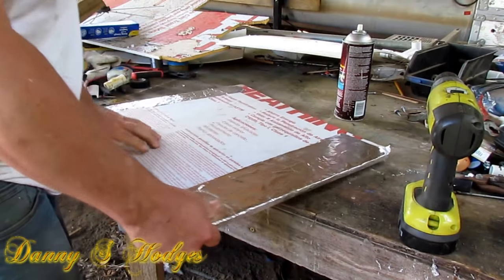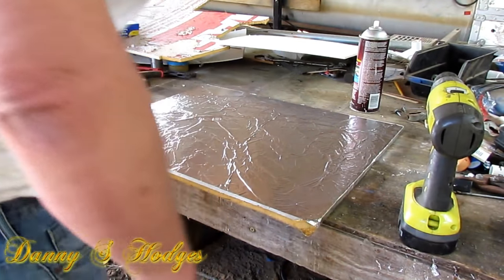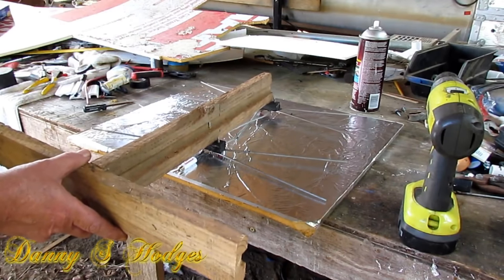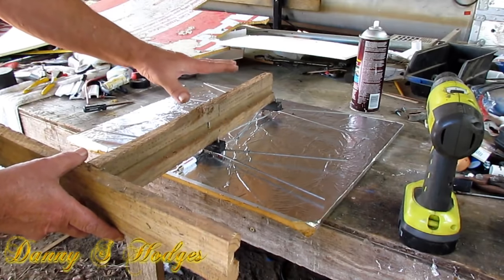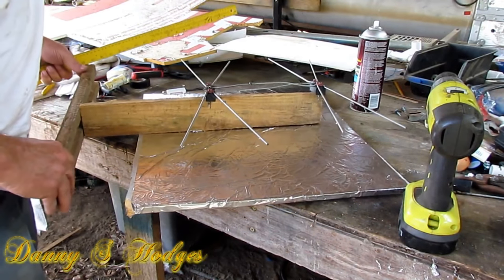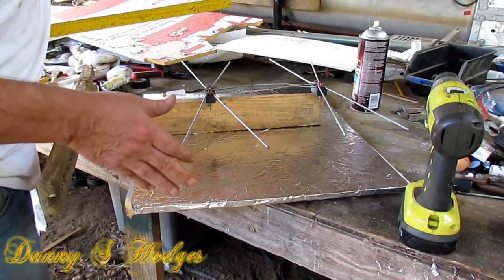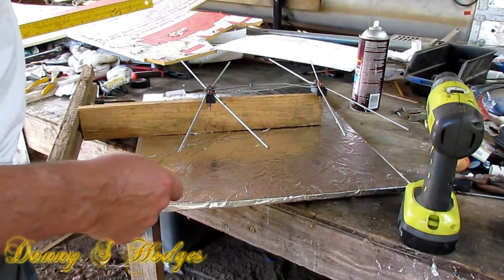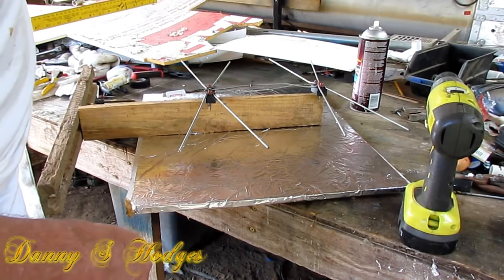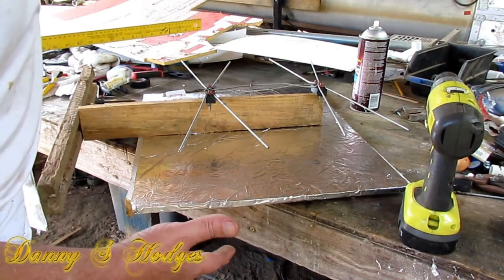I'll give you a measurement tip. You want your reflector bigger than your wires — you don't want your wires overhanging. And if you're real close to the TV towers, you might not even need that reflector. You can put a booster on this if you need to, like if you want to reach out further. My opinion about a booster: let's say your TV antenna is ten foot high off the ground. I think a booster will add to it like where it's thirty foot off the ground — that booster makes a lot of difference.